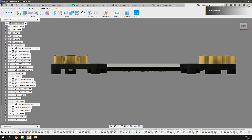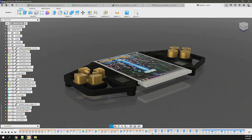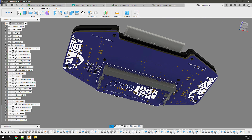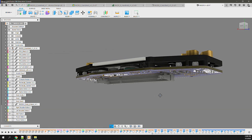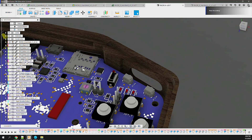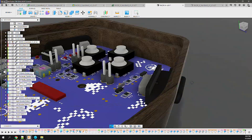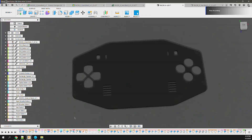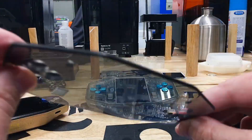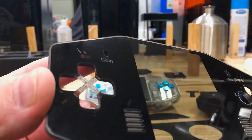A subframe was created to attach the circuit board and hold the components in place while providing structure to the handheld. Also incorporated into the subframe were a couple of sealed and ported speaker enclosures tuned around 80 Hz, designed to give solid performance from the tiny speakers while helping out the low-end frequencies. The enclosures were sealed using laser-cut vinyl making them airtight. I used four M3 screws and several standoffs built into the body to bring it all together. Shoulder and trigger buttons were made larger to feel better during gameplay, and the power button and internal power slider were also redesigned to be easier to operate.